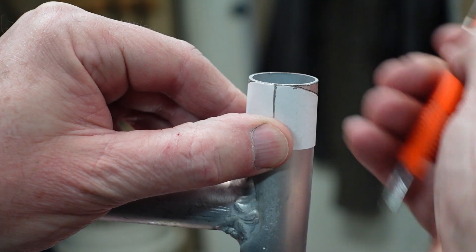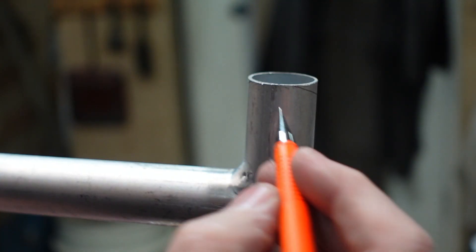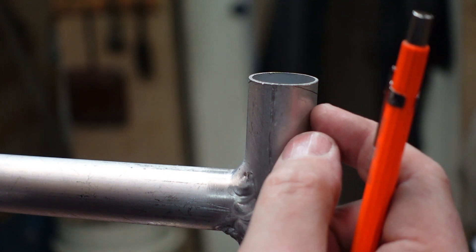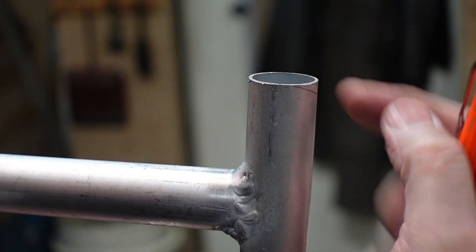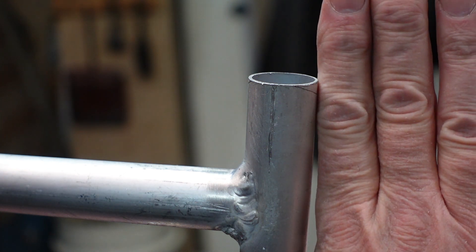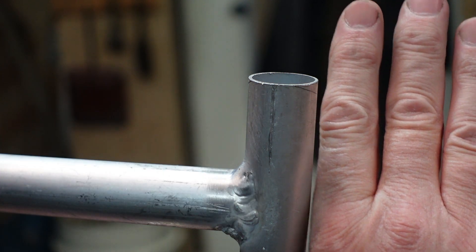The interesting thing is that although the curve on a bit of paper is probably best described as a cosine, that mark will be straight. So I can then use an angle grinder with a suitable cut-off wheel to cut that off, and I've got my angle set so that the bend should be parallel with the plane that the two centres of these tubes make.